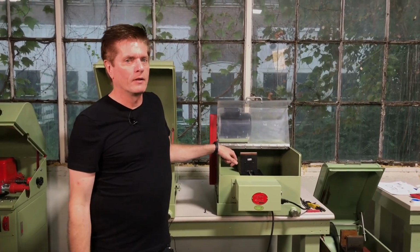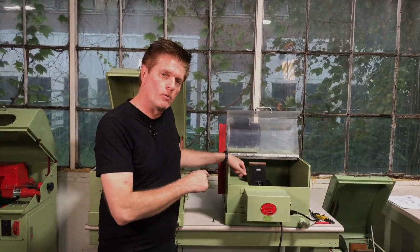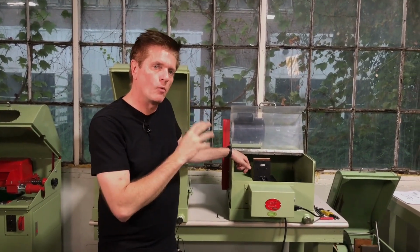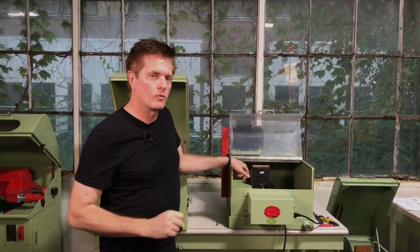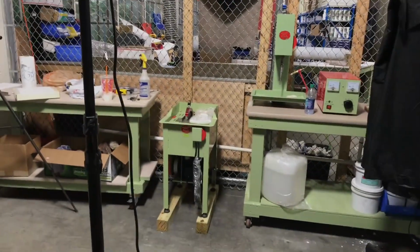what coolant should I use? Well, if you have a friend that tells you to run water, don't listen to your friend, because he's an idiot. You don't wanna run water in a saw like this, except under very rare conditions, because running any kind of water-based coolant in any of our Highland Park saws will void the warranty, save this saw over here, the production trim saw, that will work fine with water, and also the drop saws, they work fine with water.